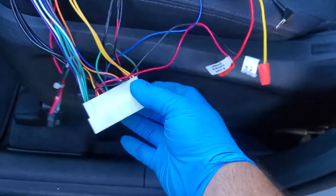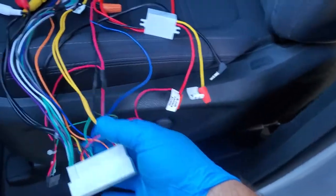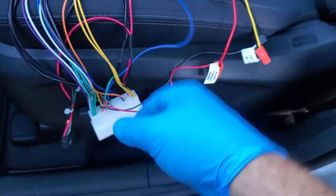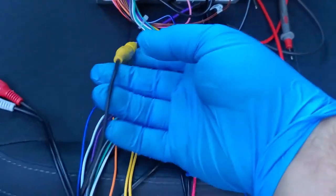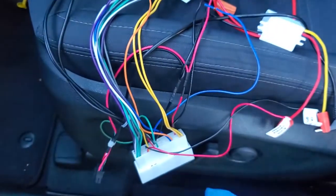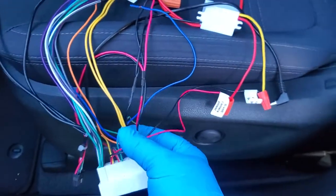The red wire is the 6-volt output, and on the other end you just connect the red and black to the input side. For the video signal, use the yellow RCA connector here with the camera. That's it for the camera wiring.